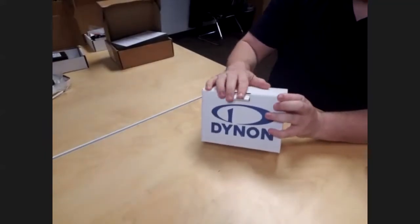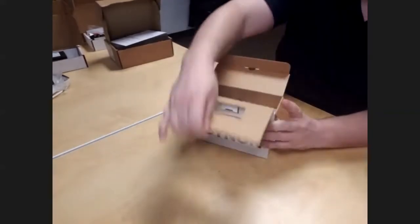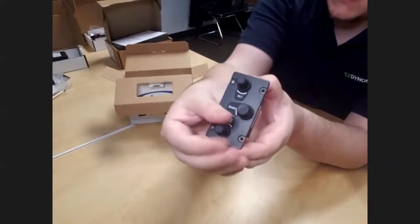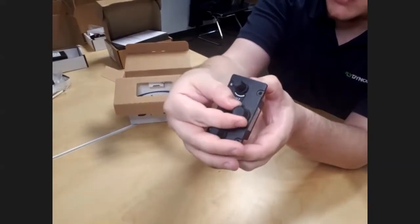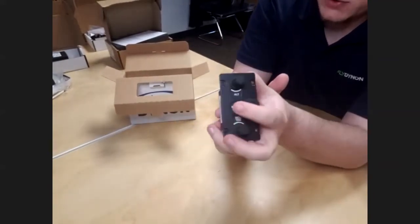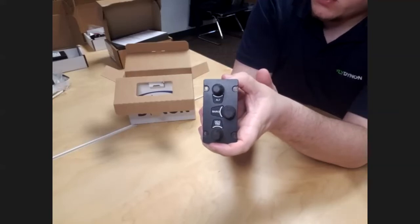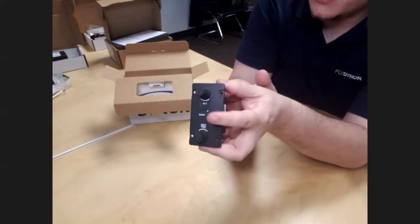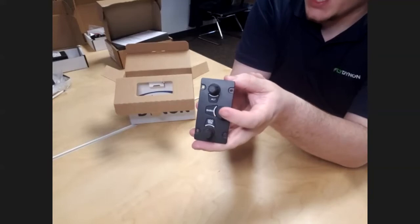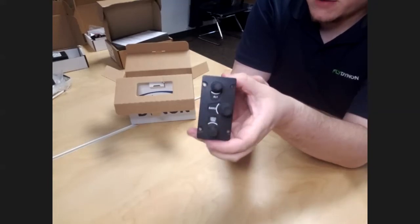So this guy is really useful whether your aircraft has SkyView and an autopilot or not. This is three dedicated knobs for the most commonly used functions. You've got a heading bug, an altitude bug adjustment, and also barometric pressure. These are all push button as well. Pushing the heading or the altitude will sync it to the nearest figure, and pushing the baro will either sync the Kollsman window to match GPS altitude if you're on the ground, or if it's receiving ADS-B and knows the nearest broadcast METAR, pushing that would load up the nearest value. Also, if your destination is within, I believe, 20 miles, this will sync it to your destination METAR, so that you are already synced up by the time you get there.